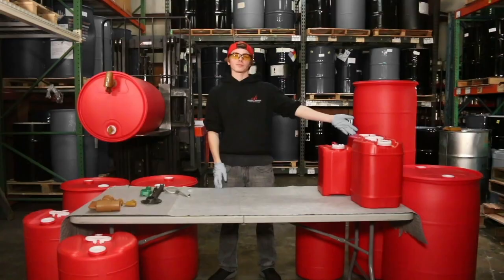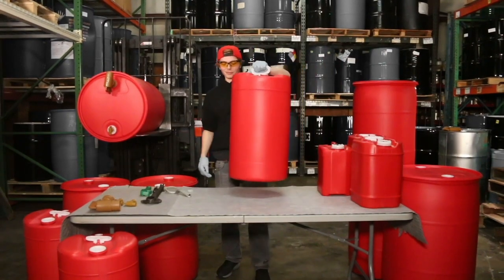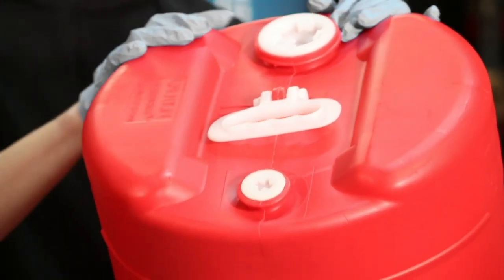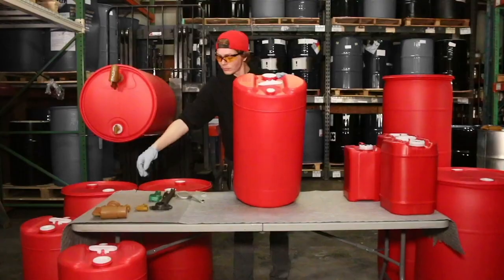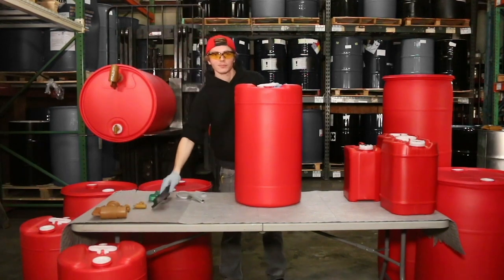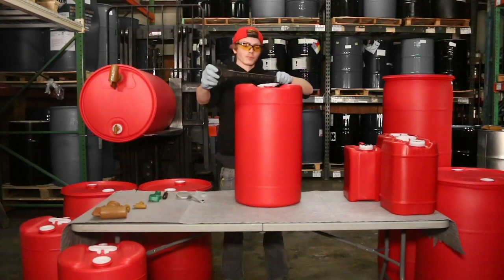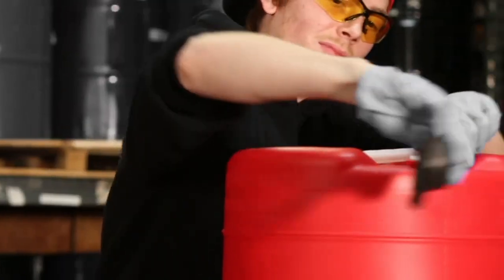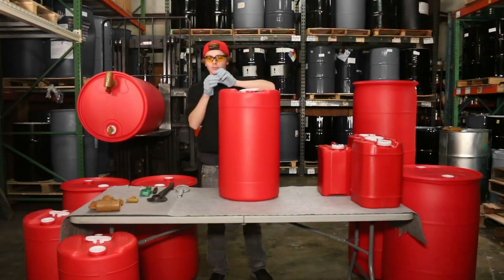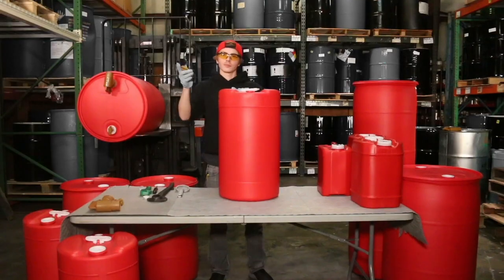You open up the 25 pounder the same way. Moving on to the 100 pound drum — you see we have a 2 inch bung and we have a 3/4 inch bung. We're going to show you how you can add a spout directly onto the container to make pouring a lot easier. Using the tab on the bung wrench, put it into the slit and unscrew the 3/4 inch bung. This is threaded so you can add the 3/4 inch spout directly onto the container. We'll put in the description below where you guys can purchase one.